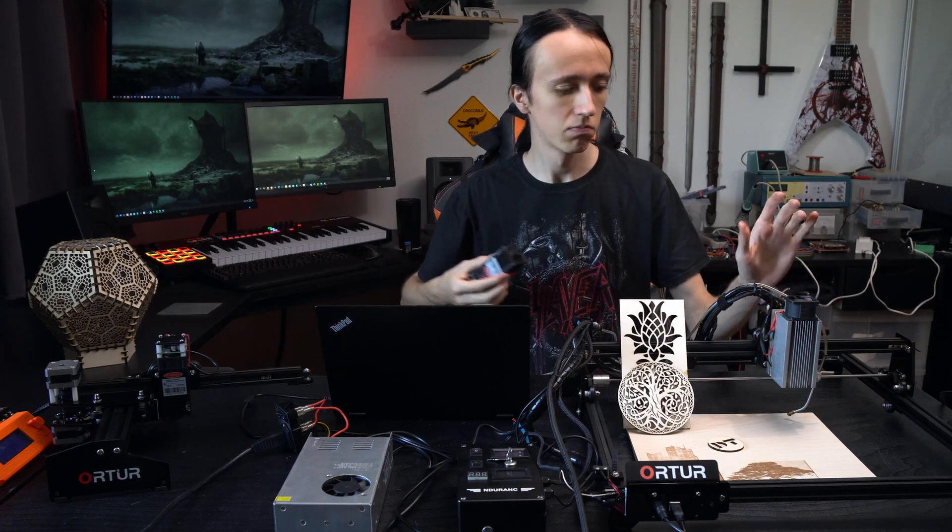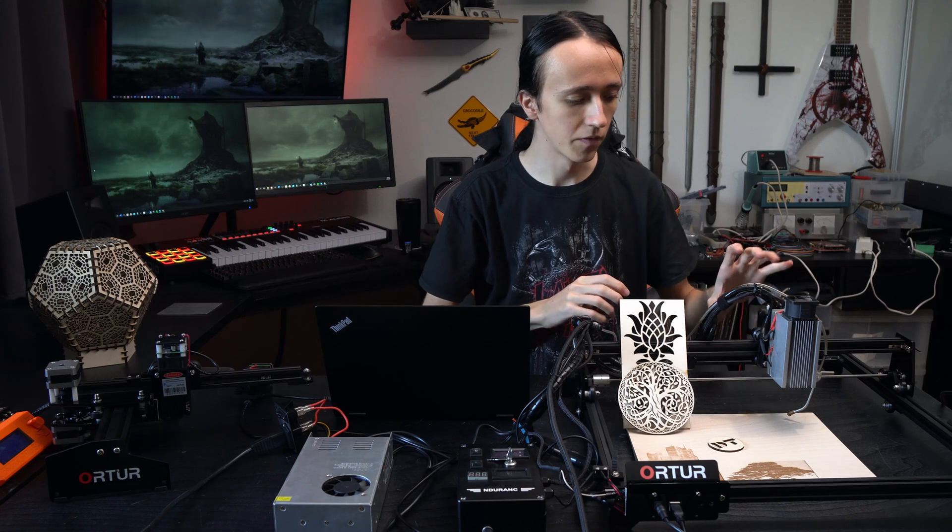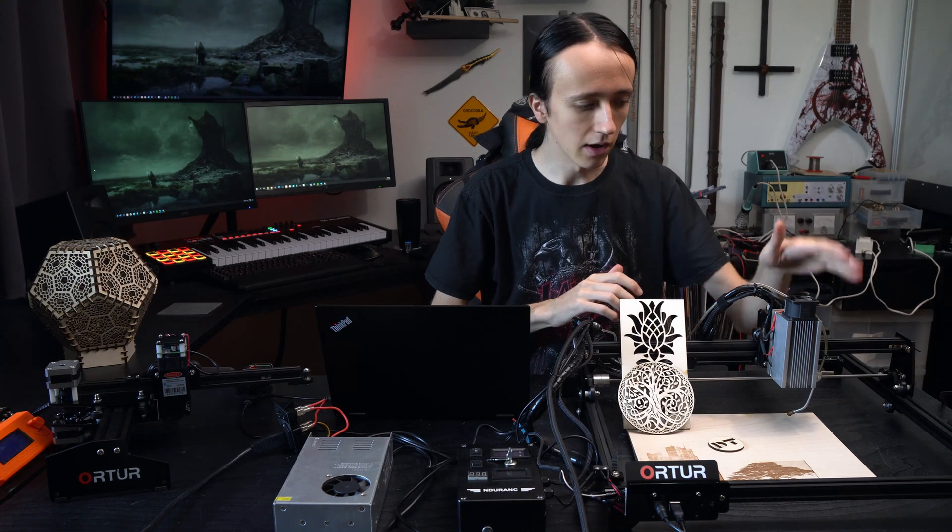I have completed the conversion and it was actually pretty straightforward. The only thing I had to do was drill some new holes in the acrylic plate that the laser was mounted to. I just measured them on the laser, drilled the holes, and bolted the Endurance laser to the already existing plate. That didn't take more than about 10 minutes.